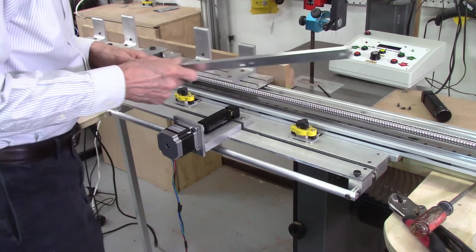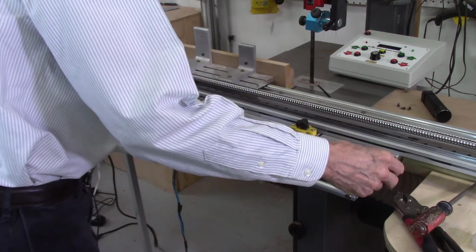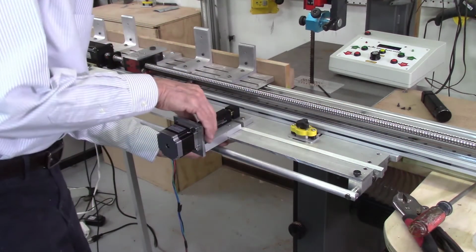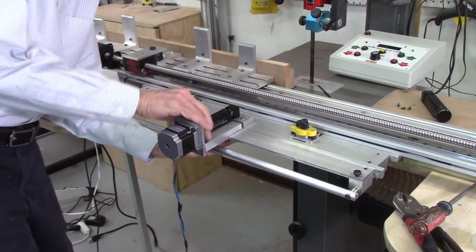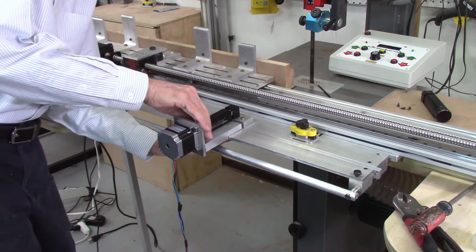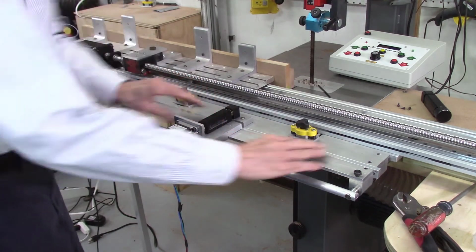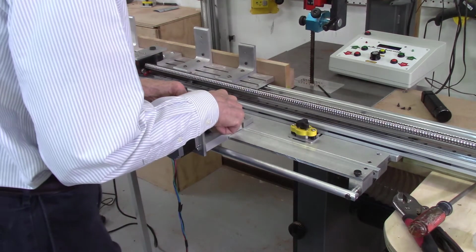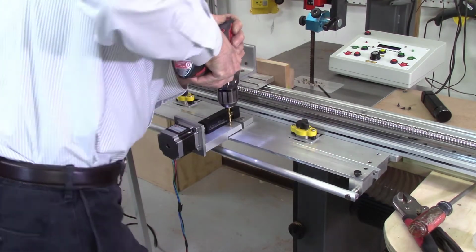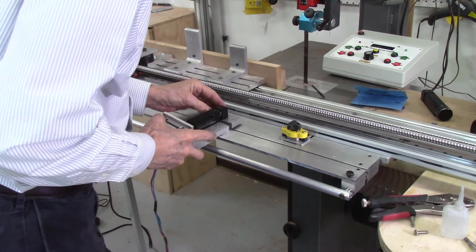This is how I do this when I align a system after I make them. I put usually a 1/2 inch or 5/8 inch bar through here and then clamp these tight, and that just makes sure everything stays nice and parallel as you're attaching everything. So I just turn this, now these 2 are tight and have bars, so these 2 plates now are perfectly parallel to one another. Now I can go ahead and drill the 2 holes. Okay, so let's go and reattach the system.